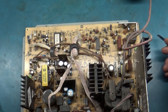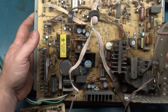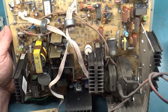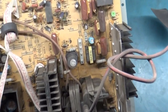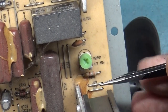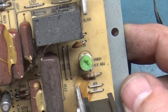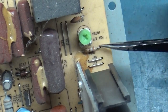There's nothing really left to do but do a cap kit reflow and then test it one last time since it was fully working. Before doing all the work, I should mention that there are two separate B+ adjustments here. There's one that says 'HV Adjust' — I'm not sure if that's high voltage or horizontal/vertical, but I'm pretty sure it's high voltage adjust. Then there's a secondary one on the other side that says 'B+ Adjust'.